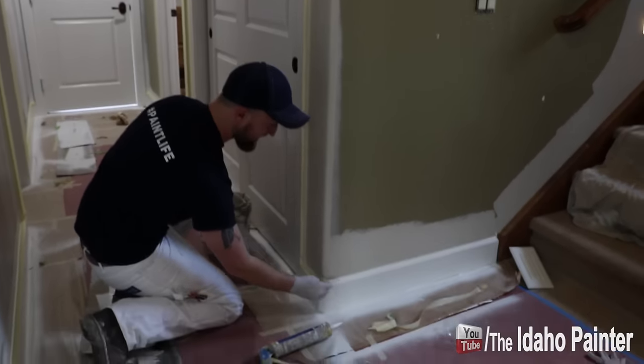Make sure you've got enough space away from the wall so you get that nice crisp clean line. When you apply your cut-ins, there are a lot of situations that vary — you're not always gonna do them at the same time. You could roll your first coat and then do your cut-ins, roll your second coat and then do your cut-ins, or do your caulking and taping method before you roll your walls. We do get comments from people saying a real painter should be able to cut a straight line without tape, and that's true — eventually as a professional you want to hone your craft to cut freehand. But one of the benefits of this process is it helps get brand new guys, helpers, and apprentices to be more productive sooner. A guy who's been with us two months and never picked up a paintbrush before can mask a nice straight line, caulk it, pull it, and produce at a higher level than they would freehand.